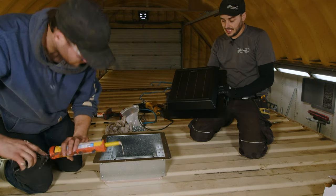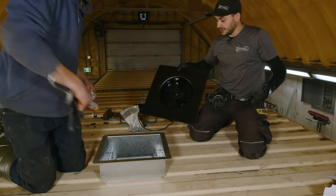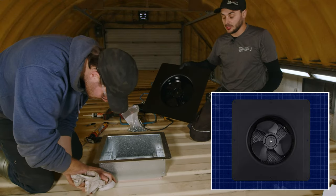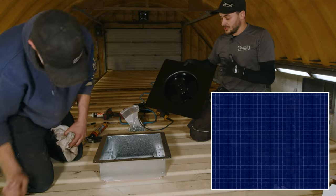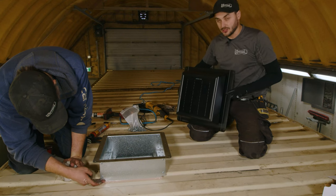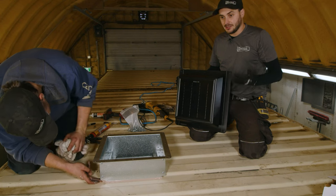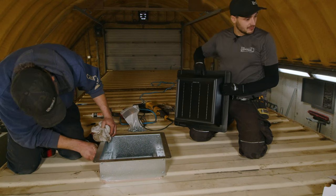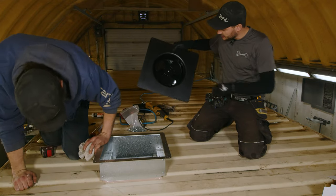The solar panel is perfect because during the day the sun's beating on your shipping container, radiating heat inside and getting super hot, and at night it cools down. This fan is directly run from the solar panel — there's no battery. The battery is the component that would typically fail, especially in the north where they freeze. We've been selling these for a couple of years now and haven't had any callbacks.